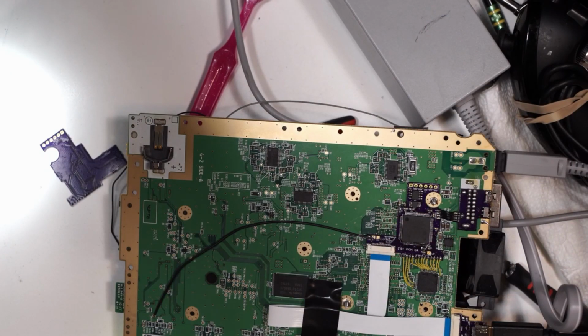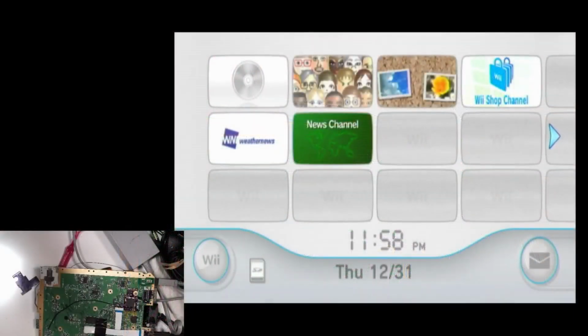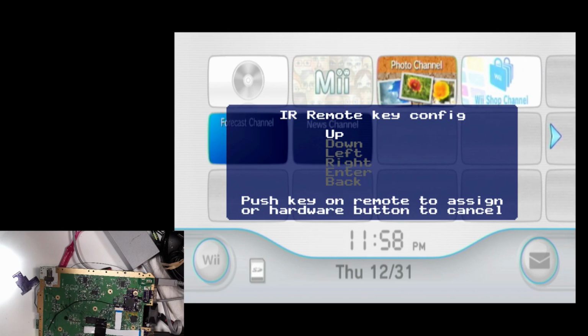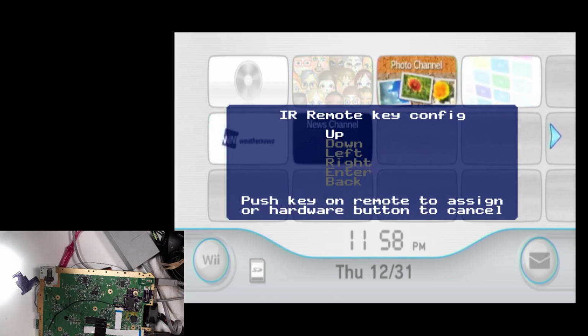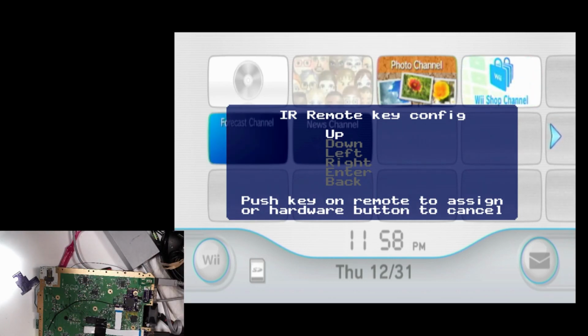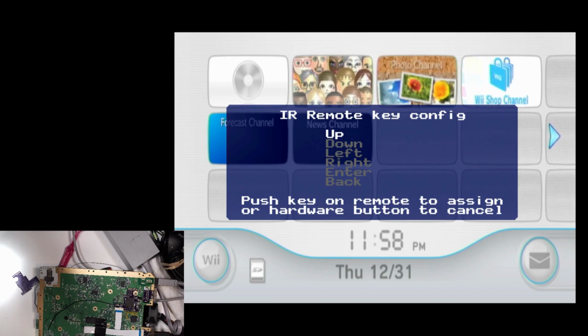A few moments later. Hey, welcome back one more time. So, infrared is working now too. And by working now, I mean it was always working, but I didn't read the documentation on how to actually use it. So, turns out you have to hold down the button until you get this menu right here. You can't just simply press the button. I know it's stupid. I should have read the documentation on how it works. So I've got an OSSC remote, one of these Chung Hop learning remotes, and it's set up for an OSSC, which is the correct protocol for the GC Video. So we're just going to program up the buttons.